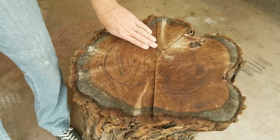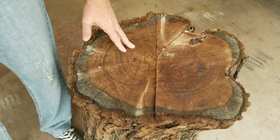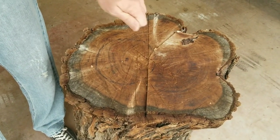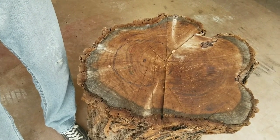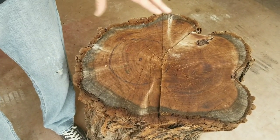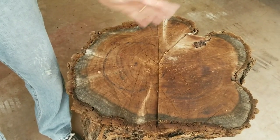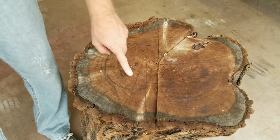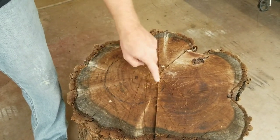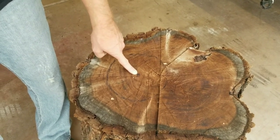I'm also saving a flat area because when you do your shrinking you're going to want a small area to hammer the shrinks out flat — not to flatten them but to capture the shrinks or tucks so that your aluminum or steel is actually shrunk. You work it to where you smooth it out mostly, then take a planishing wheel and finish the smoothing. I've already made a six or seven inch circle in the center, so we're ready to get started on cutting.